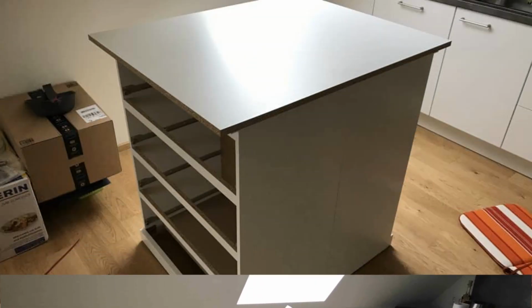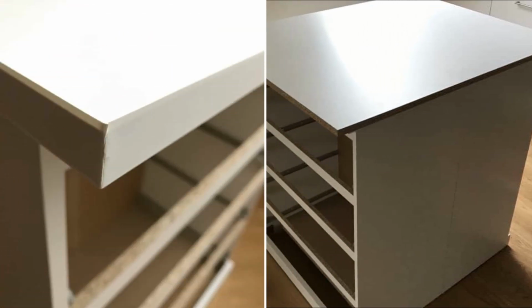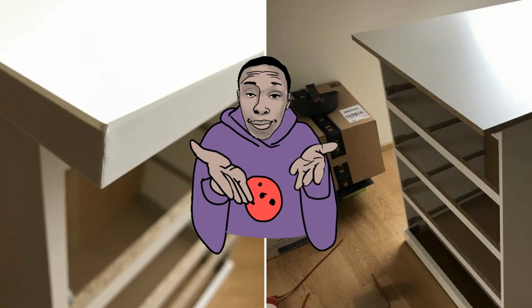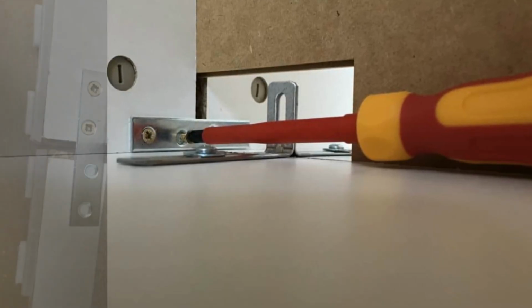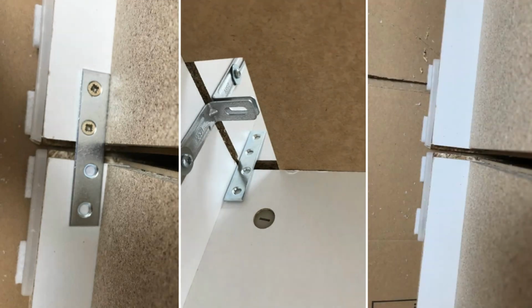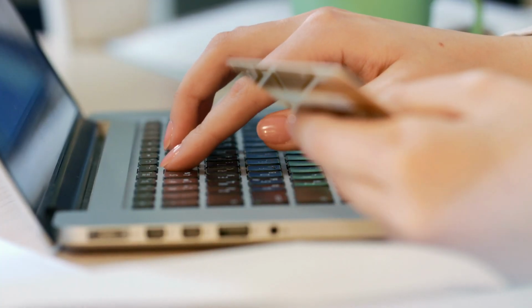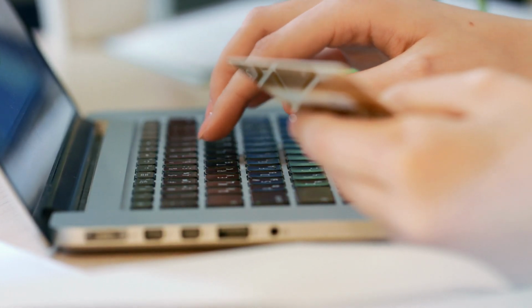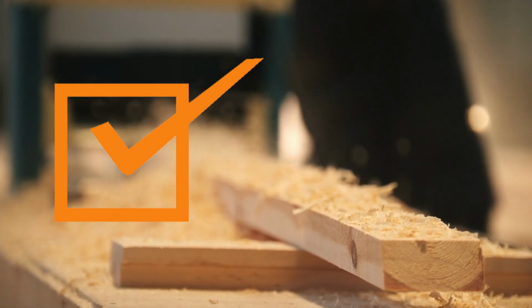First, you'll need to build the body of the dressers without the drawers. That's right, just leave these pesky drawers out of the equation for now. Next, screw the bodies of both dressers together for stability. Then add a coated chipboard surface and some edge bands to prevent any dirt or liquids from sneaking in. And here's the kicker, you can order the panel online with the edging already attached. Or if you're feeling adventurous, you can do it yourself for a bit of cost savings.